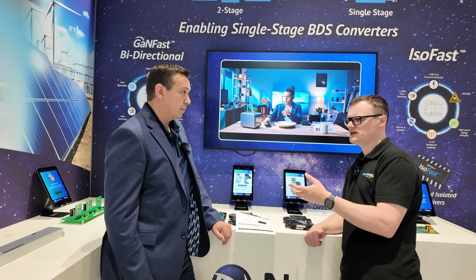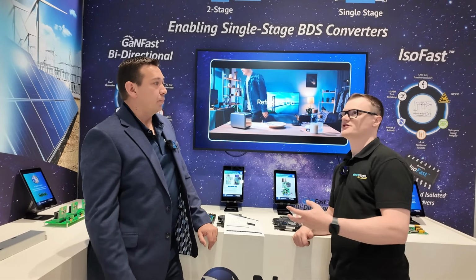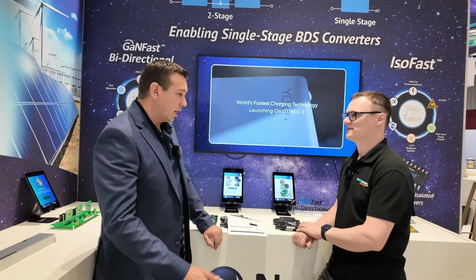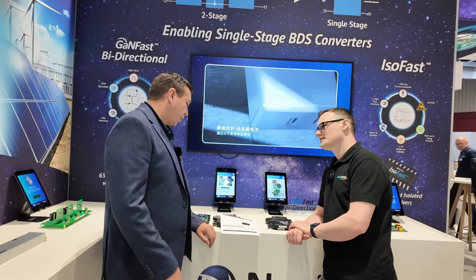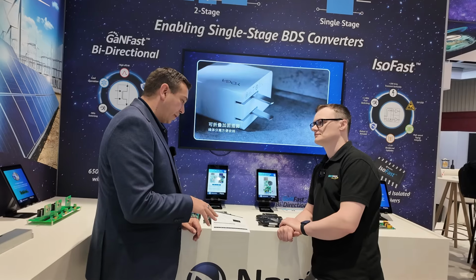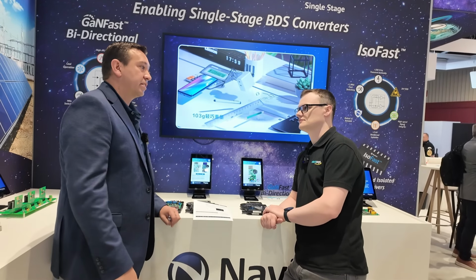Would that mean you would only need the one device? Well, you have three phases, so... Okay, three, but one per phase, effectively. Yeah, that makes sense. So EV is a big market for this. We're launching this now at 50 milliohms and 100 milliohms, but there's a roadmap, obviously, for lower RDS(on) parts.